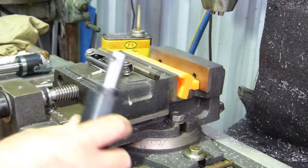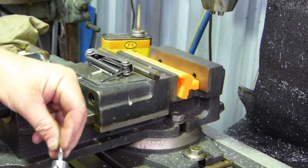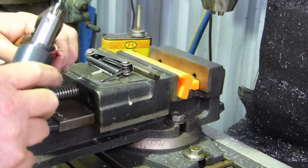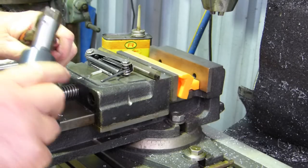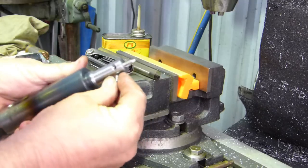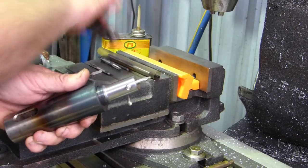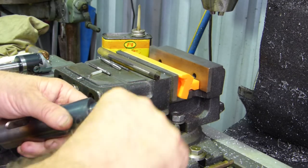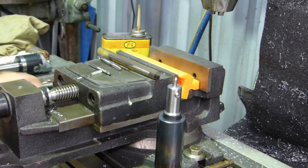Yep, that's going to be a good thing. I'll get this out, get all the rubbish out, deburr it. Well there you go — that's the little tool. I have a centre drill that I've ground a flat onto, just as a way of stopping it from turning. We pop it in so the flat's there, pop the grub screw in, and tighten that up. Job done.